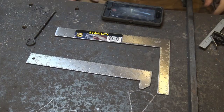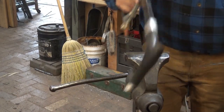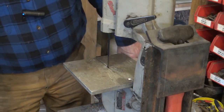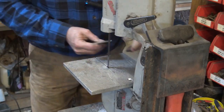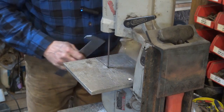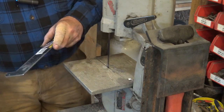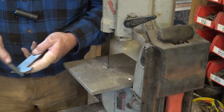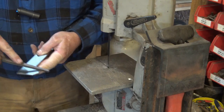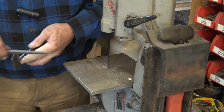I would buy a new, lower-budget square. That's useful just like it is, but I still want to lop that corner off. I usually do this in the little port-a-band — it makes nice, quick work of it. That's basically the whole job right there, except there are sharp burrs on here. So I would take a fairly fine file and file the burrs off, or what I usually do is use a fiber deburring wheel on a grinder, just real lightly — just enough so there's no sharp spots. It's going to be a tool you'll have the rest of your life, so you might as well make it nice.